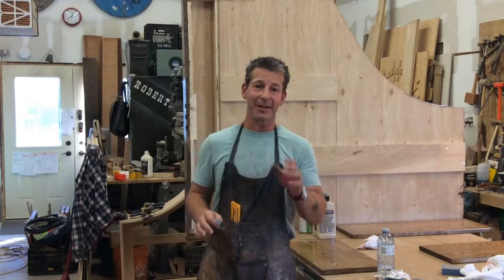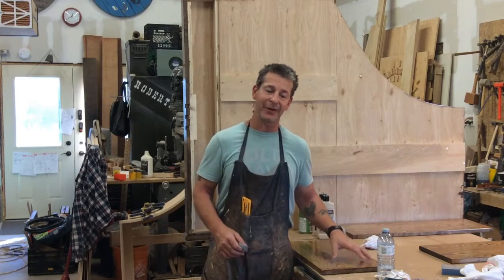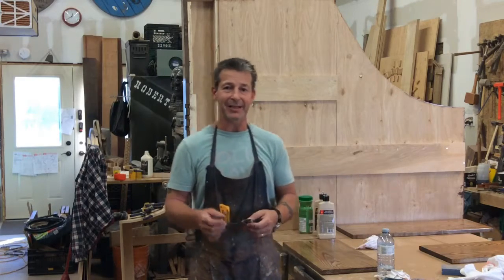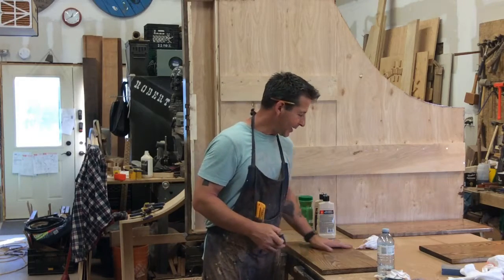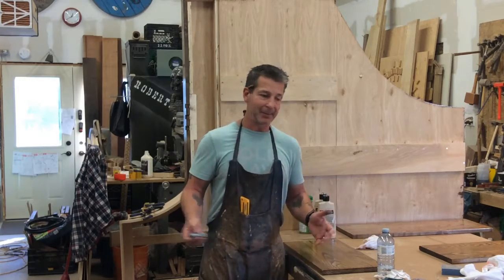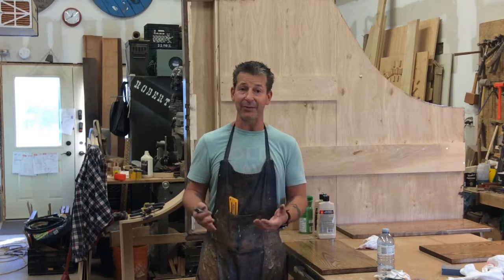It's been a few days now since I've turned the camera on, so I'll give you an update. I didn't bore you with me applying five coats of the Gloss 900 Varathane product. Of course, I applied that with a brush, so despite all my attempts using a natural, thick bristle brush, I still have some brush lines. They're not that bad, but they're still there, and I don't want them there, so now comes the extra work, as opposed to what you would have to do if you were using a hand rub poly.